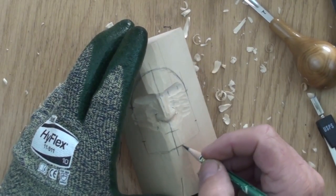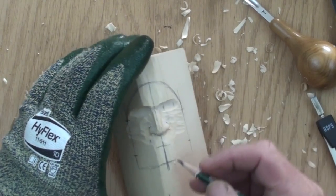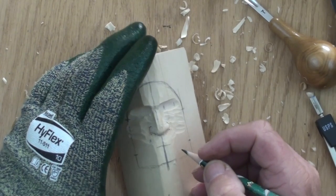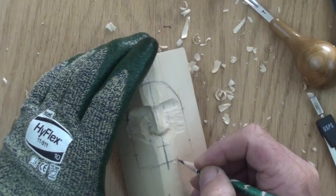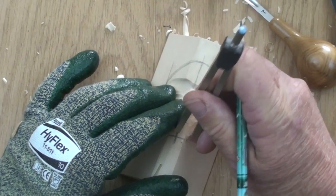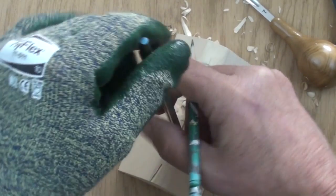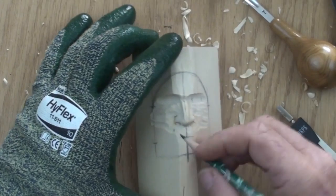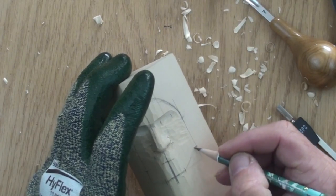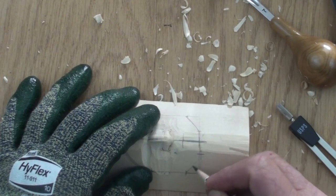Now his chin is going to be coming around here, and let me see, I need to make that a little straighter. Okay. I need to decide where it's going to turn. So I'm going to come off here, oh, about the end of his nose right here, say. I can take my dividers once again and set it on that mark, whirl it around, set it there, just put me a little pin prick. Now then, see, he's going to come here and then he's going to turn, come back here, like so. Same thing over here, come and turn here.